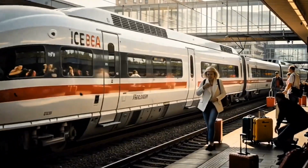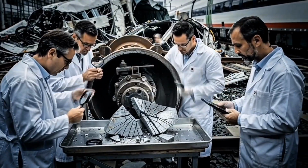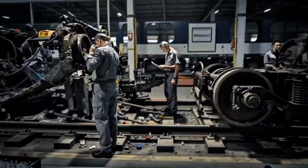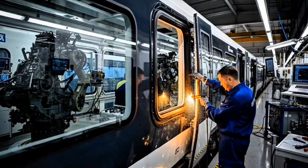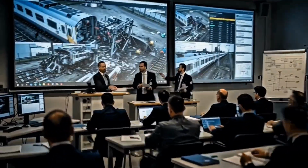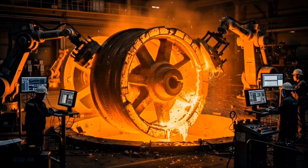Following this accident, the wheels on all high-speed trains were replaced with monoblock designs, and many bridges around junction points were rerouted, so that such an accident does not happen again. Germany reevaluated its entire railway system after this accident. Pressure-proof windows were replaced so that if there is a need for rescue in future, the people trapped inside can be taken out by breaking the windows. Even today, the Eschede disaster is taught as an example in the railway training centers of Germany.